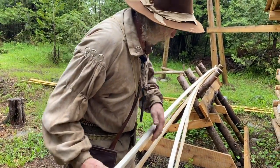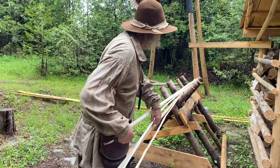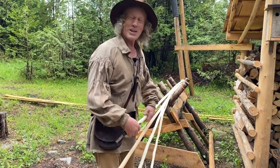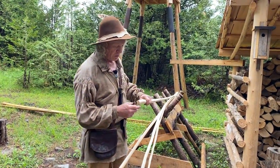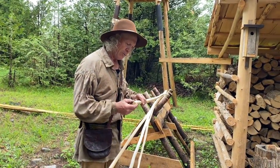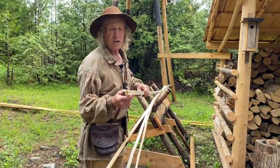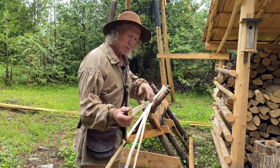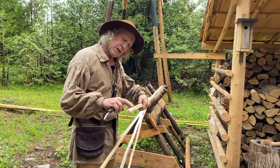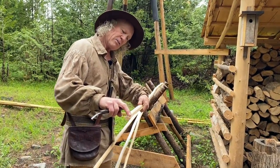Okay, I have completed with new material. Second time I've completed it, actually. So, second set of gunnels. So this is going to be the inner gunnel, and what I've done is I've shaped it a 1-inch square. They're about 16 feet long. I'm going to be shortening them, and then I put a 45 degree bevel on the back side.